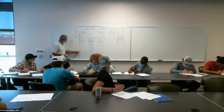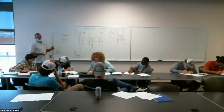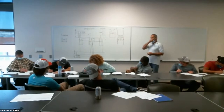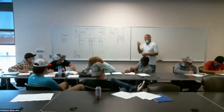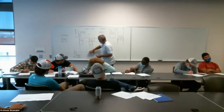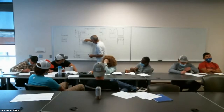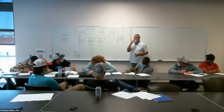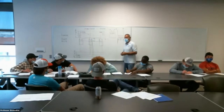Why do I get on my A phase, which is my high leg transformers, 208? Times it by 1.7. That is the solution. But why am I having to times it by 1.7325? Because three phase, one of them is going to be out of order than the other two. Just remember you're combining a different primary phase. But I took the first two, B and C, how many phases was I using? One. When I took A, I'm taking part of this transformer and part of that transformer. That's why I'm getting 208, the 1.7325. I'm now using this phase and this phase to get my voltage. Okay?